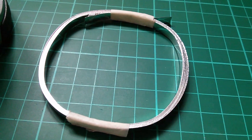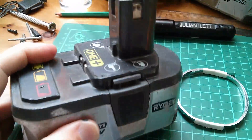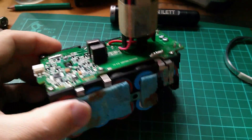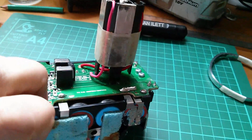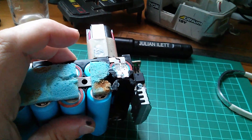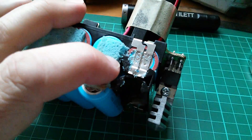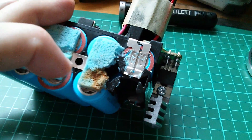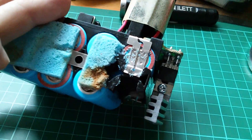Now the reason I bought this bus wire is not to make solar panels, but to repair power tool batteries. I bought a couple of these Ryobi lithium batteries — these are the big ones with not five but ten 18650 cells inside. I've already taken one of them apart and identified that out of the ten cells, these two up at the negative end of the array were faulty. Now they are paralleled, so both had died simultaneously. Getting this top one out is particularly difficult because there's this plastic separator between the two rows of cells, so I've had to cut the strips here. My plan is to put cells from the other pack back in here, put solder on these strips and then use the tabbing wire to bridge across those solder joints.